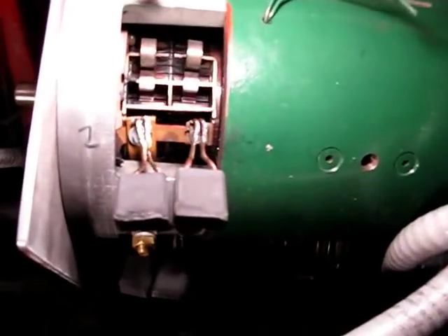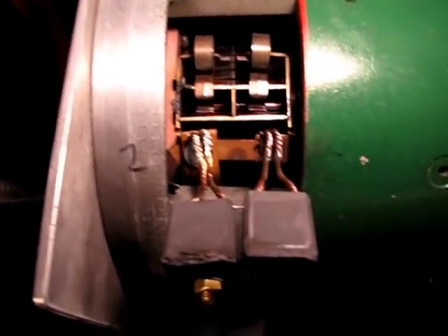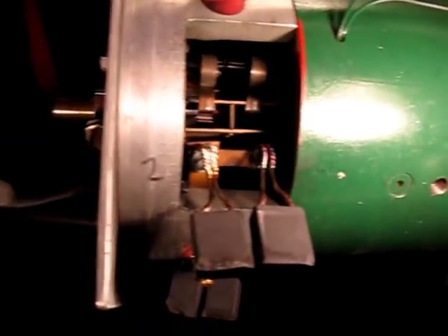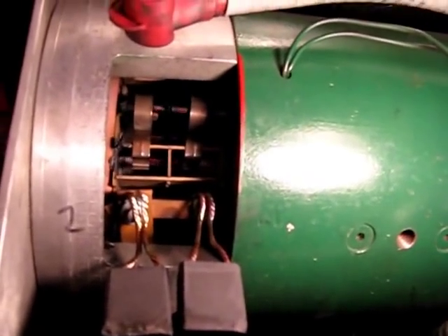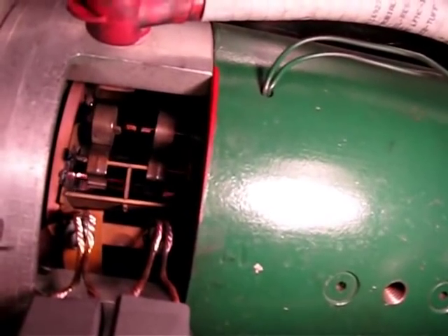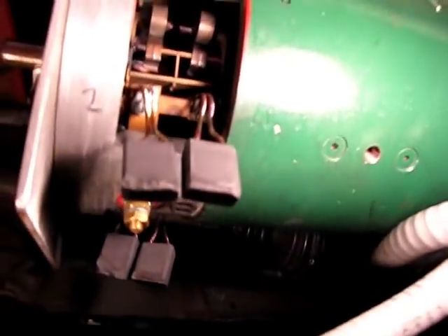I don't know if I'm going to be able to make this out on camera, but actually the commutator doesn't look too bad. It doesn't have the brush material on it evenly, but you can see the copper of the commutator and it doesn't really look that bad. I'll try turning the motor — there are currently just two brushes still engaged, and there are still crusty noises, which is probably those two brushes ripping along. But otherwise I don't see any major damage to the commutator.